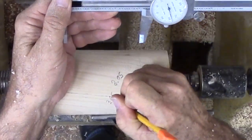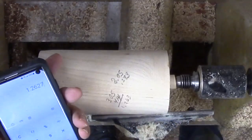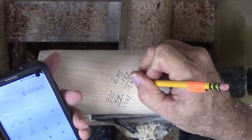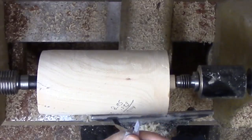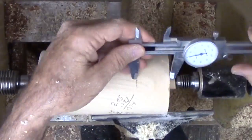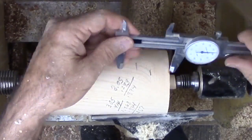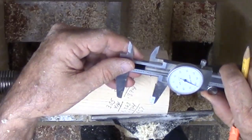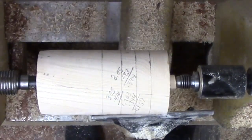My cylinder is just over three inches in diameter. Using the octagon method is actually easy — I will mark lines along the side of the cylinder. 3.05 times 0.293 gives the distance from the corner of the cylinder to a corner of the invisible octagon. 3.05 times 0.414 gives the length of any side of the octagon. The diameter is also the overall length of the cylinder containing the octagon.